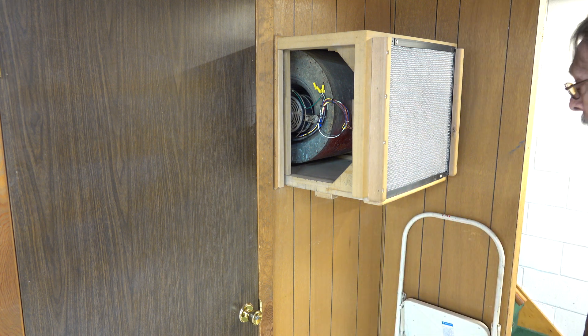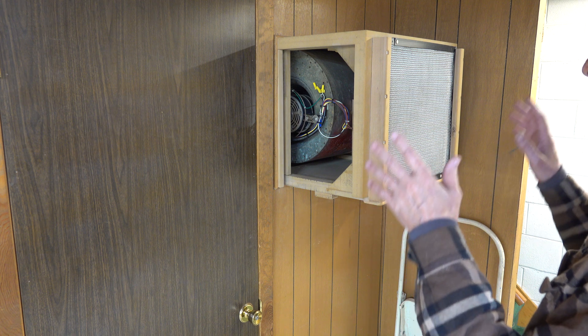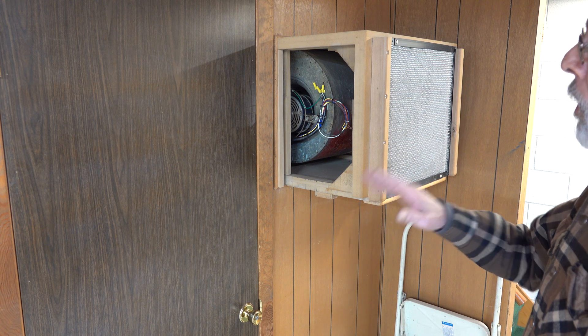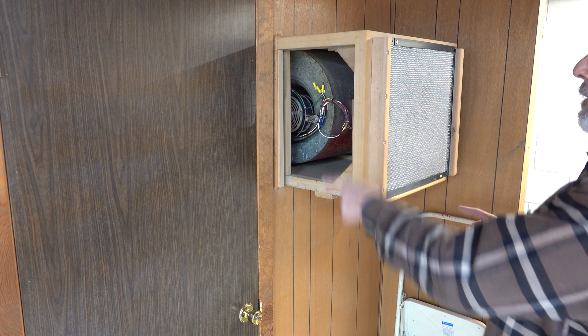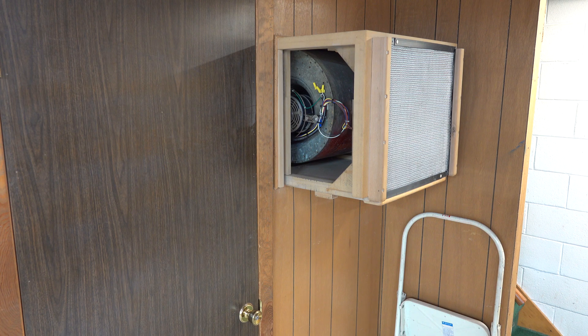This is throwing a little over 10,000 CFM. But here's the cool part — this whole shop has a circular motion, a spin to the clean air. All dirty air is entering right here. Clean air is starting on the other side. And I'm going to show you how cool that system is.